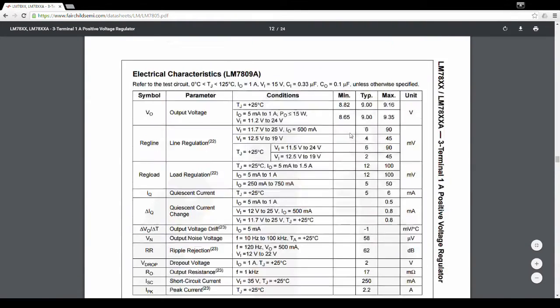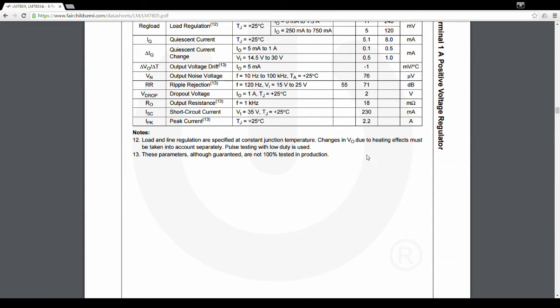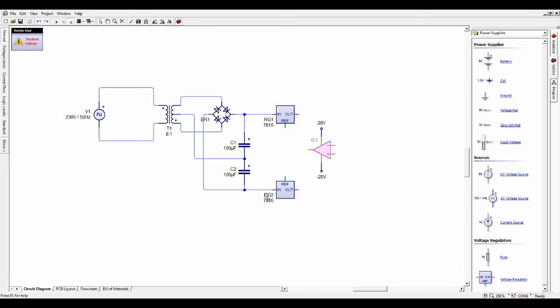And let's try and make the adjustable output regulator instead. So let's pause it. So let me just cover what I've basically done. I essentially dragged in an op amp, and added the power supplies 20 volts and minus 20 volts, which is the same as the voltage on this wire, and this wire essentially unregulated, but it doesn't really matter for this example.